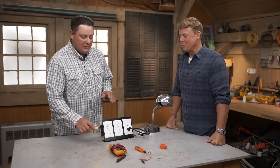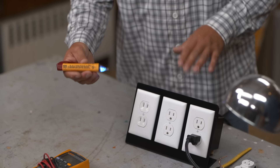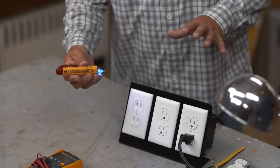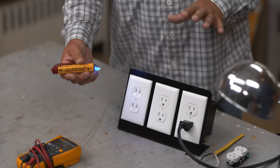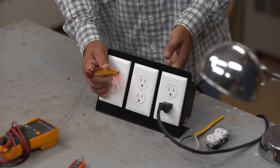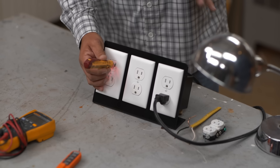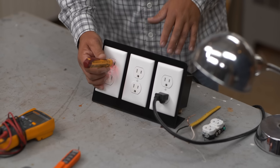So we'll start with this one. This is one of the easiest ones to use — something a homeowner ought to have. It's just a contactless voltage tester. Now it's not going to tell you what the voltage is, but it's going to tell you whether something is or isn't energized. We can put it to that prong — hear it chirp — we can tell there's something going on there. We don't know how much, but we know that it's energized.